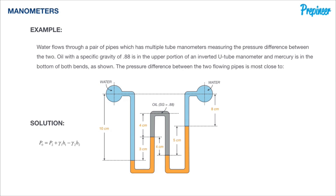To get started, let's go back to page 104 and grab our general formula. As you can see, it's right below the solution title — it is not going to fit this situation at all. But if we don't fully understand the foundational components of solving these types of problems, we're significantly handicapping ourselves on exams, because we'd be relying only on formulas provided for an open-ended U-tube manometer, which is just one of many different configurations. Knowing the foundation of why and how these formulas are built will prove much more beneficial on exam day.